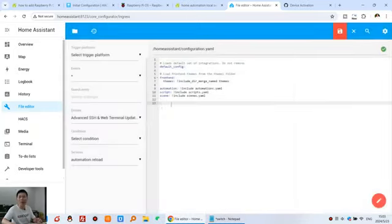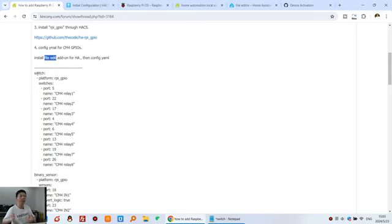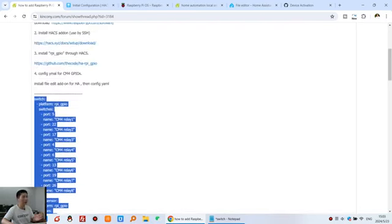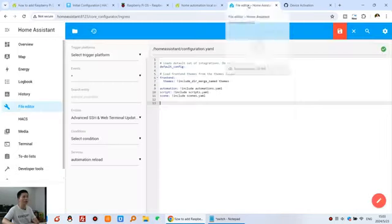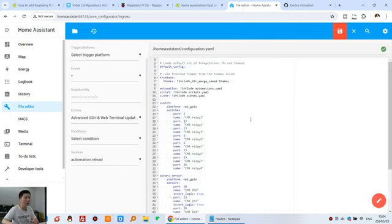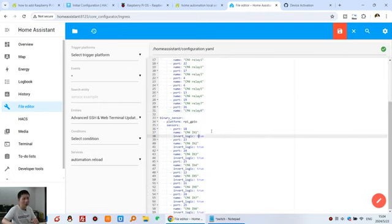We can add code here, at the end. Because we have 8-channel digital input, used for binary sensors, and 8-channel digital output, used for relays, just for 8 switches, you can create the 8 switches and 8-channel binary sensors. We have already written the code, so you just copy it and paste it here. You can see the switch names CM4 relay 1 through CM4 relay 8, and the binary sensors CM4 input 1 through input 8.